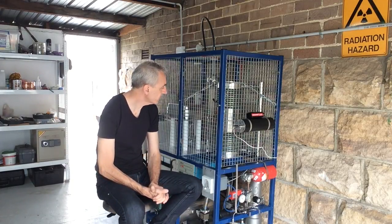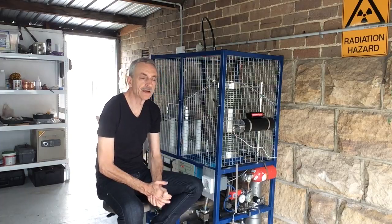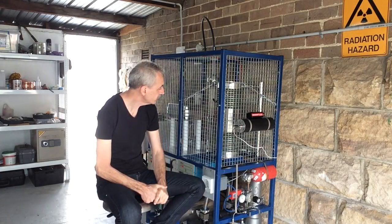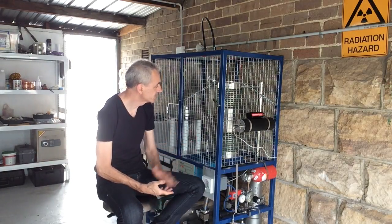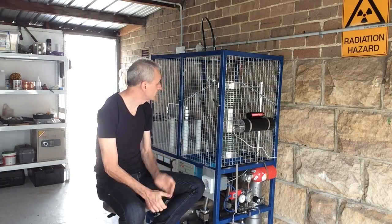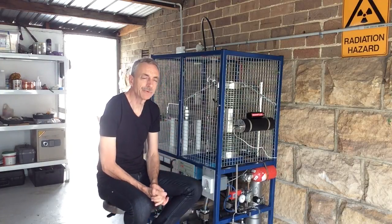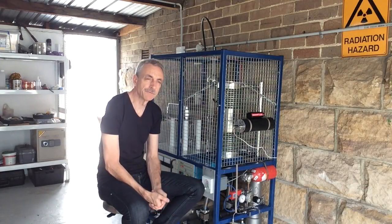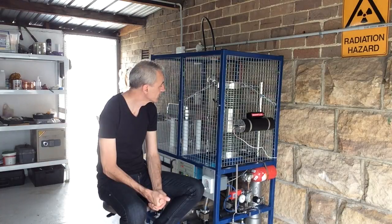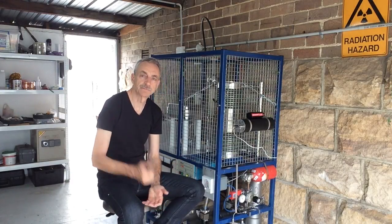Initially I'd like to try to make some changes without building a whole new chamber, so if there are small changes I can do which will improve it I'll try that first. If all that fails, I'll have to redesign the chamber, but that's a big job I want to avoid initially. One thing that could improve the system would be an ion source, but the way I've designed it, it's not easy to retrofit one. I do have an NPT quarter-inch tap in the chamber where the gas goes in — it's a little small for a high-voltage feedthrough, but it could possibly be drilled up and re-tapped so we could fit some kind of grid inside to create some ion activity. Other than that I don't have any suggestions, so I'll be happy to hear from you guys.